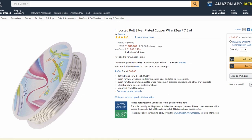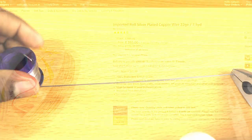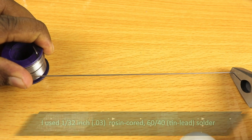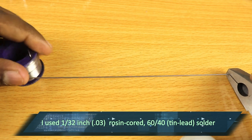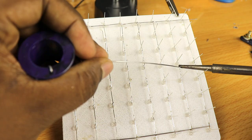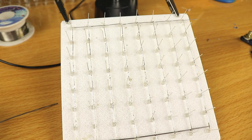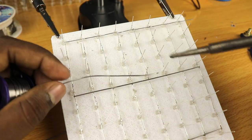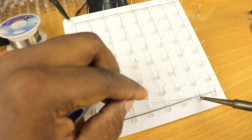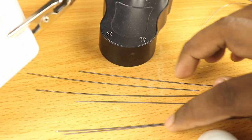There are quite a few ways of doing this, and one such way is to use silver-plated copper wire. But since I don't have this, I'm going to try out a crude method — stretching the soldering wire stiffens it, so I'm going to use that for support. Apply some solder on the cathode pins before using the soldering wire to give support. Using it in the center and sides should give the cube the strength it needs.